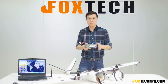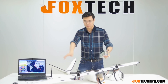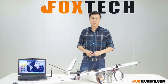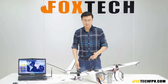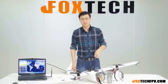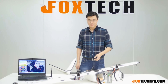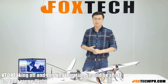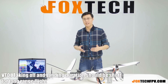It's a 10,000mAh 6S LiPo battery — the weight is 1.3 to 1.4 kilograms. It's quite big considering the 1.8-meter wingspan, but it still flies very well in both multicopter and fixed-wing modes. The flight time, flying mostly in fixed-wing mode, is over one hour — so it can fly maybe 60 to 70 kilometers range. Just remember that in multicopter mode the efficiency is very low, so try to avoid too much multicopter time if you want a long range.